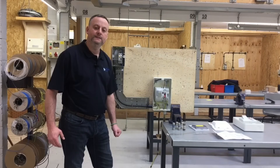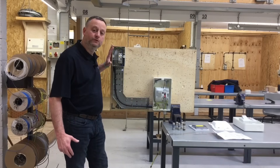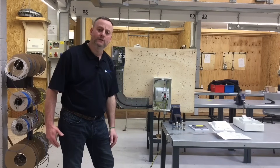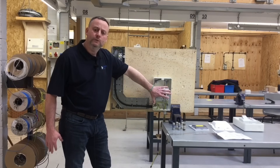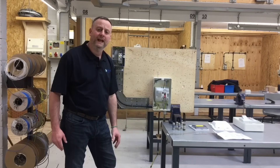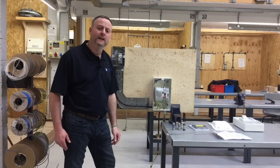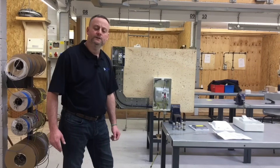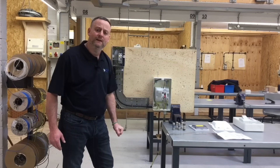In this presentation we're going to look at the sub-main circuit wired up using a steel wire armoured cable on cable tray, feeding a distribution board in another location. We have a switch disconnector fuse — often called a switch fuse on site — located in the basement of a block of flats, with a sub-main circuit going up to each floor to feed the consumer unit in each dwelling. We'll look at connections within the switch fuse and issues with the circuit protective conductor.